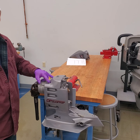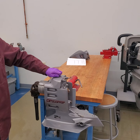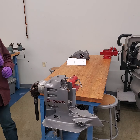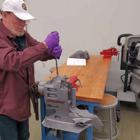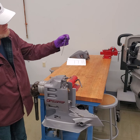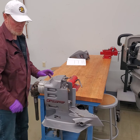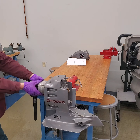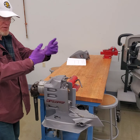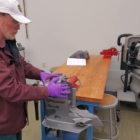Before you take it apart and start removing covers, make sure you take the dipstick out — you don't want to pop the cover off and break it. Take the dipstick off, take the four bolts off, and the input drive will slide out. Take the four fasteners off and the top cover will come off. Take the four fasteners off and remove the shift actuator.